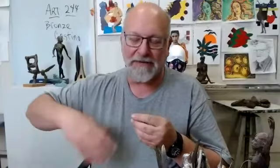Well, until I see the pattern in front of me, I won't know for sure. Sometimes, where I'm making the molds, I have to dip the patterns into a bucket full of revolving mixture of mold material, so I have some space limitations. So sometimes I cut things into pieces and cast them separately, and then I weld them back together with a TIG welder. So I can make long, thin things. Sometimes, though, I have to make editorial decisions about how I'm going to break them into pieces and weld them back together again.